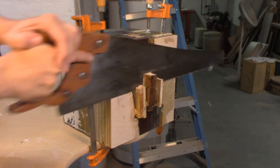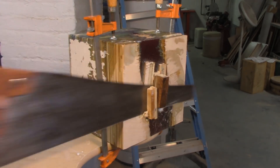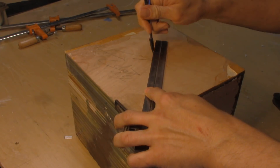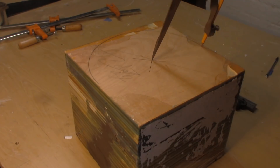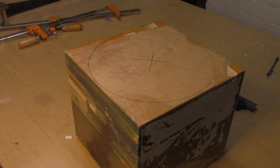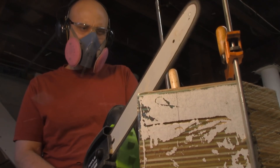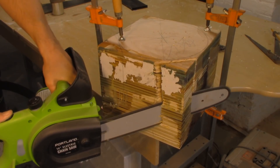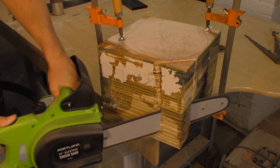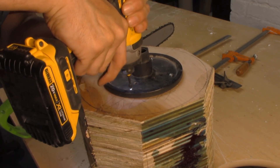The first thing I have to do is get rid of these pieces of wood sticking out, and since it won't fit on my bandsaw or table saw I just use a rip saw for that. Whenever I'm working on the lathe I really like to be precise — I find the exact center and then draw a circle around that so I know exactly what I'm keeping and what's going to be waste. I've got to get rid of the waste somehow, and here's what I came up with: a cheap Harbor Freight chainsaw, about $40, but it worked surprisingly well — pretty precise, it left a decent surface, and I quickly eliminated all the waste. You might wonder why I did this since I own a bandsaw. Because it's awesome and it makes me look like a badass. That's why. Now that I've got the waste removed I can put the faceplate on and get it mounted on the lathe.